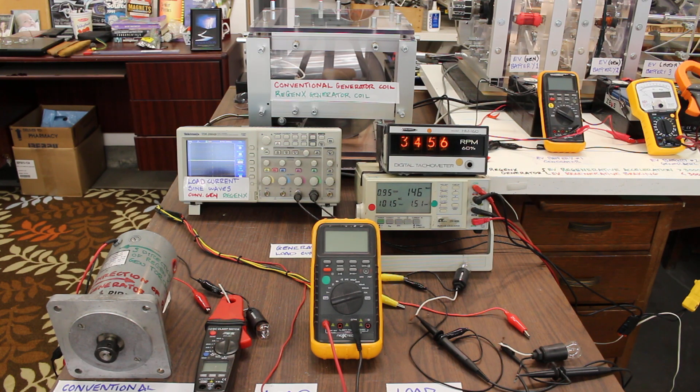Right now our generator is idling. The system is at equilibrium, which means that the net power in the driveshaft going to the generator is zero. The power in the driveshaft is the torque times the speed, and when the system is at equilibrium the net torque is zero and the net power in the driveshaft is also zero.